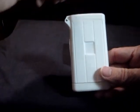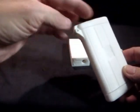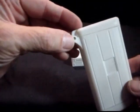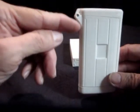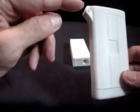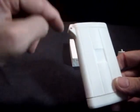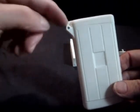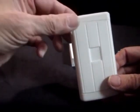The top has been cut off. They manufactured a hinge that would allow the top to open. And so I changed the print a bit so that the hinge itself is actually a separate piece, so that when it's printed it doesn't need to put any supports up the side to support the hinge. So that is a piece that I sliced off, and of course it's now reattached as a hinge, and it was printed separately, again, to get a nice clean hinge there.